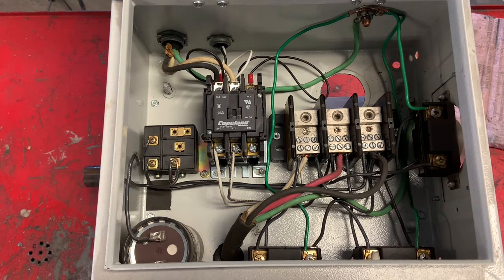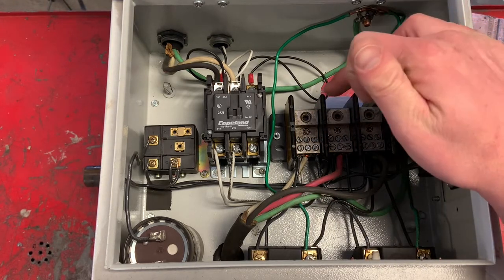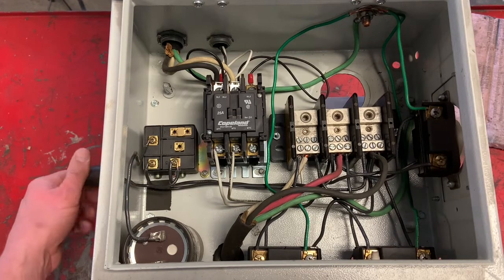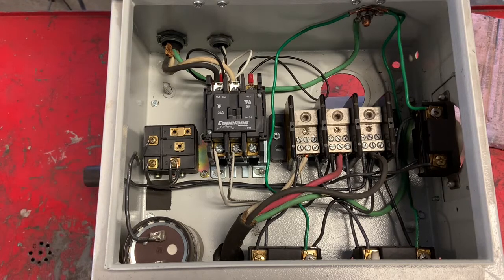I am not using balanced or running capacitors due to the fact that the machinery I'm running isn't that critical — they run fine, the voltage on each leg is about the same, or close enough anyway. If you're not familiar with that: on your three different phases you'll have like 220, 220, and then your third leg — which is generated by this rotary motor — is going to be a little bit less voltage than the other two, so it's slightly imbalanced. For what I'm doing that doesn't really matter. If you're doing CNC or something highly precision, then you'd want to balance it out by hooking capacitors between that generated leg and the other legs of the circuit.